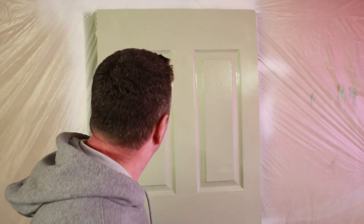Full lay off. So far so good — looks like it's had a second coat. What's nice about this being a bigger circumference diameter roller is that you can actually roll a little bit further with it; you're not running out of paint quickly. Let's see what this roller finish is like — zoom in. You can see a little bit of orange peel, which is what you get from a roller. That's why I prefer to lay off with the tips of the bristles or apply the paint by brush.